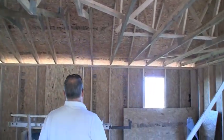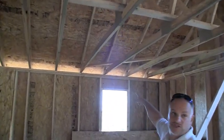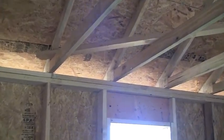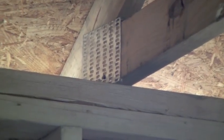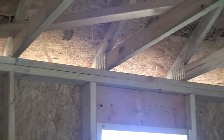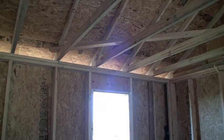How they fasten the trusses down to the top wall plate is actually a hand nail with 16-penny nails down through that gusset plate for maximum strength. Typically when you stick-frame a roof, you're just toe-nailing through the wood and you can have major risks of wood splitting or cracking — you have to add extra straps. But because we have those gusset plates, that gives us really great additional strength.